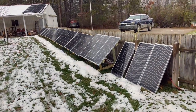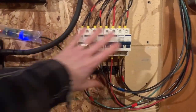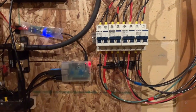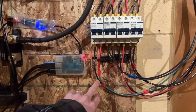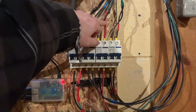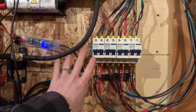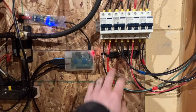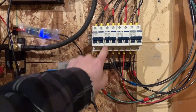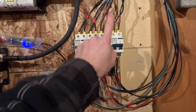You can see down here we've got another breaker. I did actually pull all these off and try to re-level this because it was canted up and driving me nuts. You'll notice black and green here and black and green up here — that's because I'm moving the arrays around to run a different test for figuring out another issue. But you can see my polarities on all these are correct: red to red, black to black — red, black, red, black, red, black. All correct. No more switching the lines around.